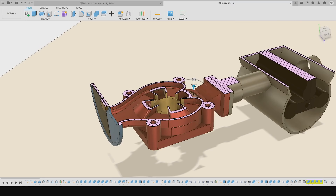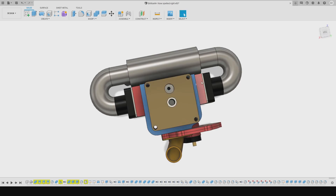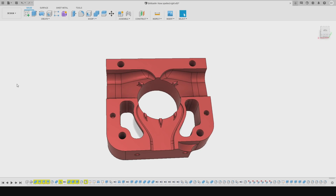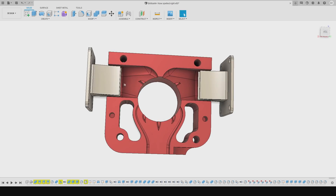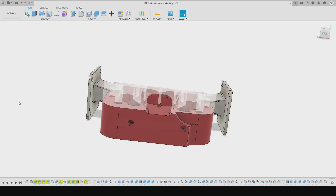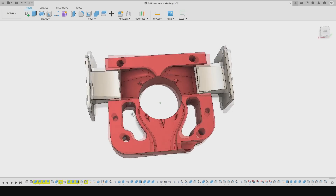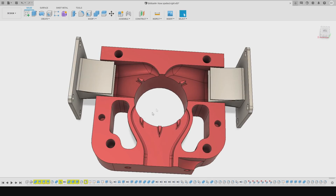This one I've made machinable in my three-axis mill. A quick introduction: still a rotary disc valve on the exhaust port, but now there are two intakes with reed valves and a plenum outside the engine. The blower will be connected to that plenum. Here's a cross section of the new setup — the two intakes with reed valves are facing straight at each other in the rear half of the cylinder, aimed upward 30 degrees. I think this might have a much better chance of scavenging the rear part of the cylinder and not mixing so much with the exhaust gases.